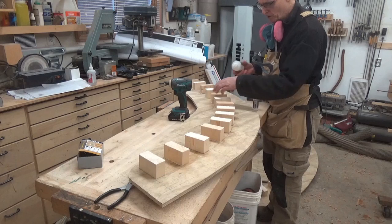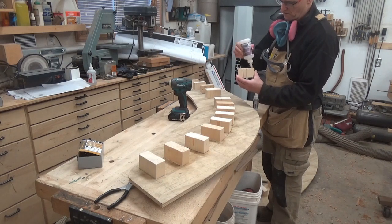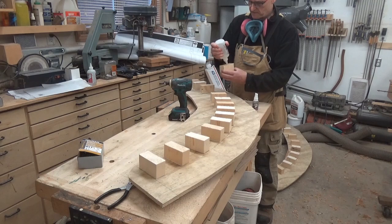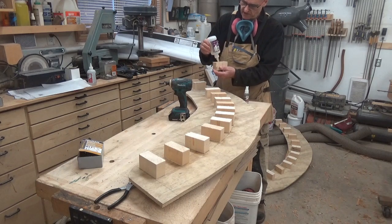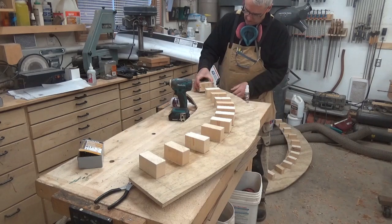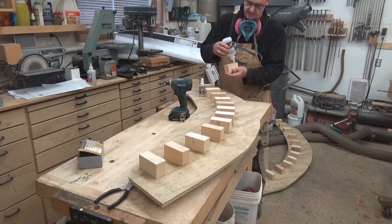I've added a few more blocks in the curved area through the ends — it's a very gentle curve, so it shouldn't need as many blocks to pull it into place. Being that the Elfin is a double-ender, there is no transom in the boat — just one stem on either end. So I've got two patterns, one for the fore and one for the aft portion of the boat, and I'll make up both and glue them up.